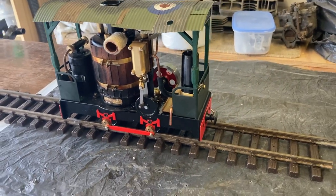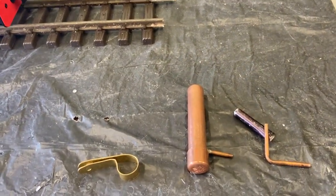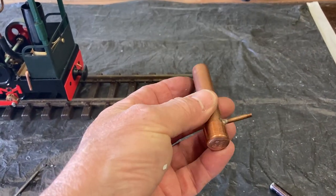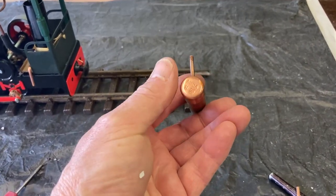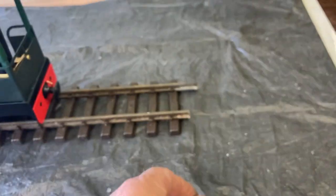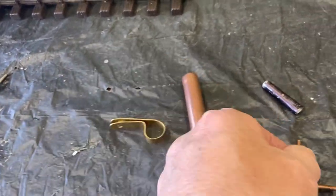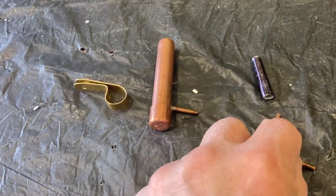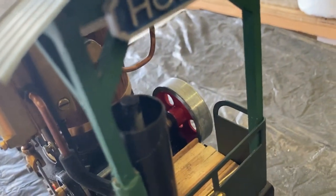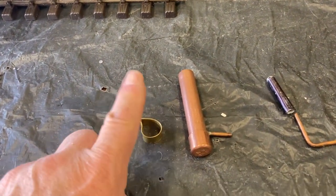Having looked at his drawing and description, I realised that the idea had some merit, so I readily agreed to make a prototype. This is the initial prototype, made from 15 millimetre copper tube with an end cap and 1/8 inch copper tube soldered in. Inside it's this shape, which fits on there, and then the homemade chuffer would fit on just inside there, as you can see.